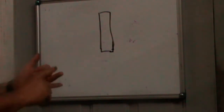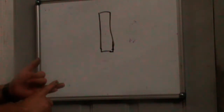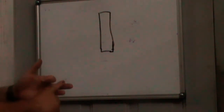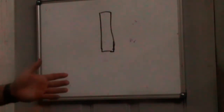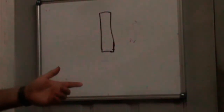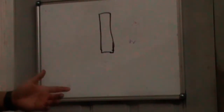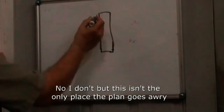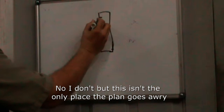I need outputs for releasing the tool, for returning the air cylinder, for cleaning the back of the new tool holder that's being installed, and for an air seal in the spindle. So that's four outputs. So I'm just going to make a manifold with a hole. Okay, let's stop right here.